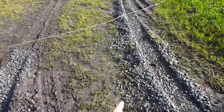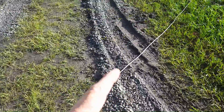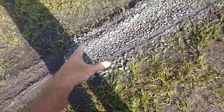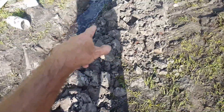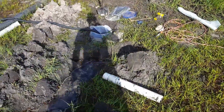This area had sunk down and they were actually getting stuck when driving through, so I went ahead and backfilled some of that and threw some gravel out here just to give some traction through the area. It's still pretty spongy because it's so wet — you can see my feet sinking into this. It just needs to dry and then it will firm up really nicely. We'll put the drain back right over here with a new catch basin and gravel perforated pipe over to the sump pit to take this water right out of here.